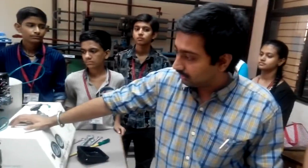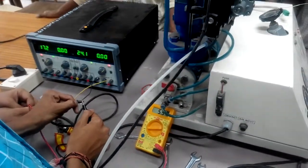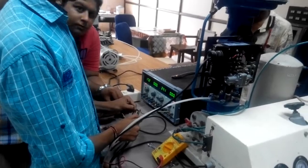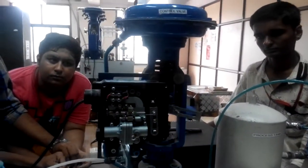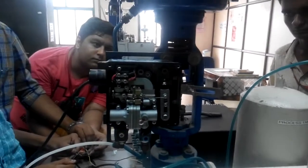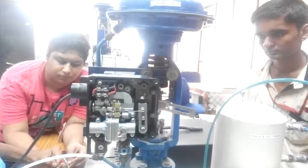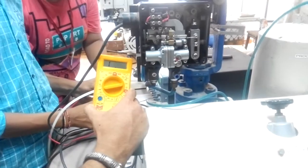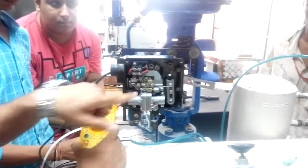Now the current is there. Let's move this potentiometer — you can see the control valve output. You can match it with different amounts of current. By varying the current, you can see the control valve opening. You can see the flapper-nozzle and how it works.